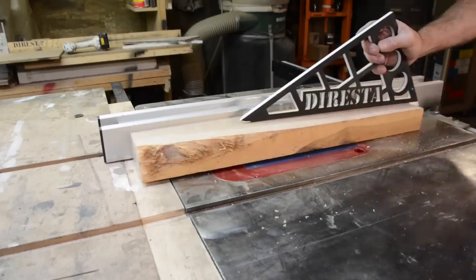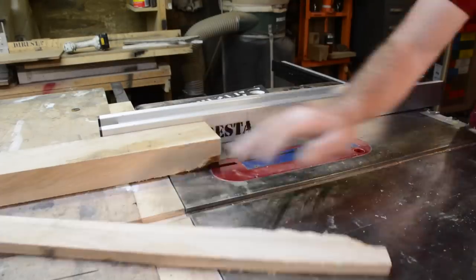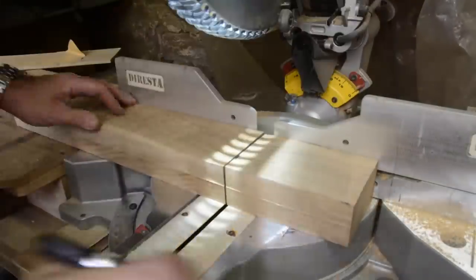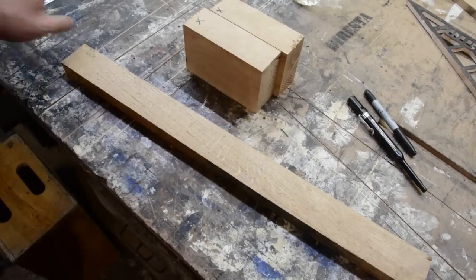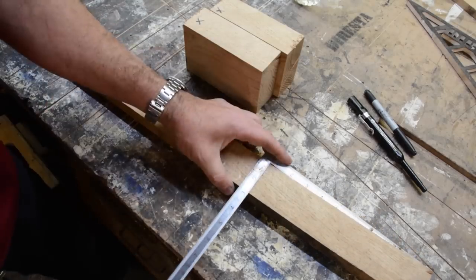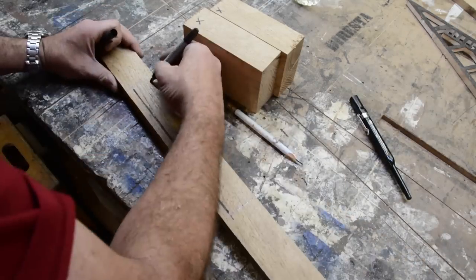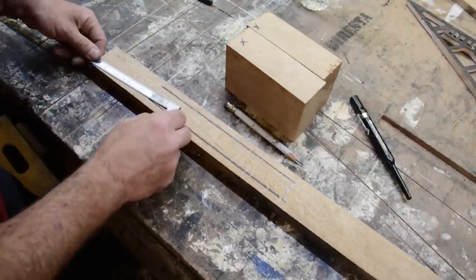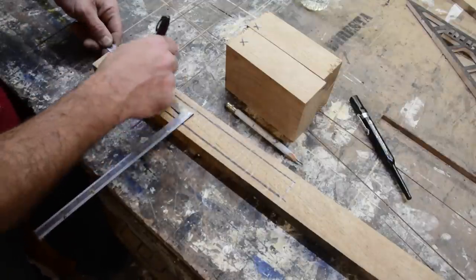Because of the twist, I play it safe with the table saw and cut it halfway up - I was afraid it would bind if I tried to make a full depth cut. You can see it rocking around a little bit because of the twist, but that's going to be gone - it's not important right now. This will be the two halves of the head of my mallet, and the first piece I cut in the opening scene is going to become the handle.